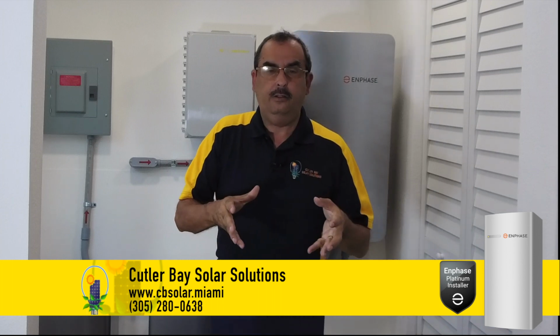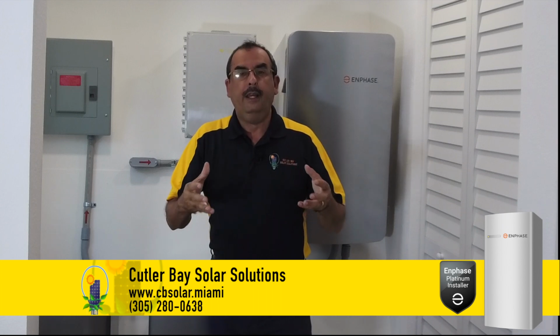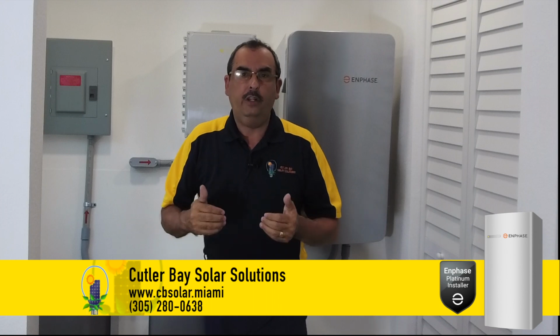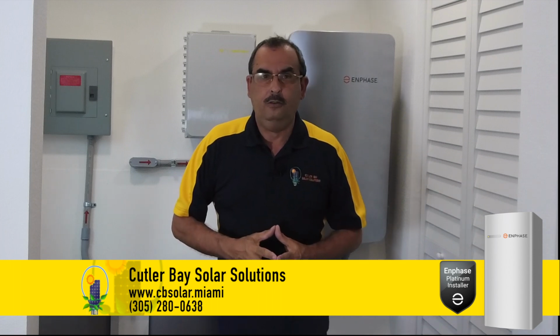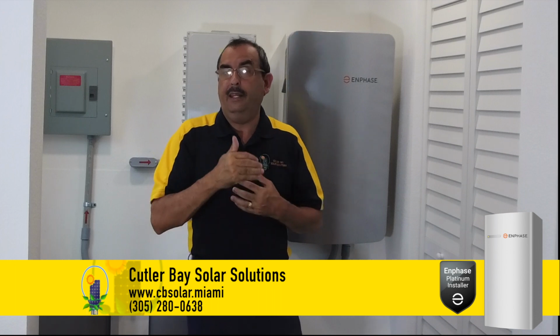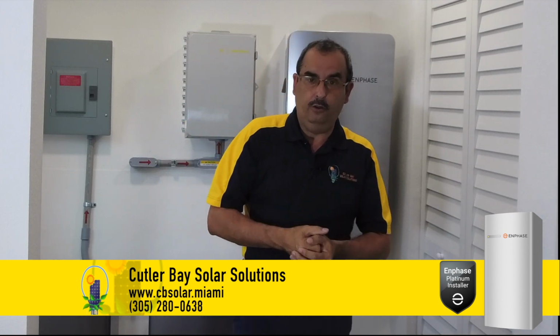This is unique to the Enphase Ensemble in Charge. The Tesla PowerWall 2 is not able to turn on your panels to operate your home. It is only able to turn on your panels for recharging of the battery. So all of our customers want to know, how many kW do I need? And that's a unique question that we can't answer in a video, that we have to look at your loads to determine what your loads are.